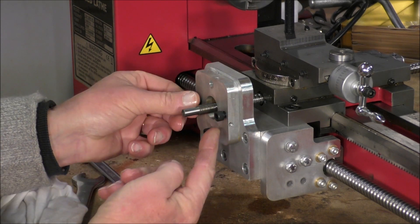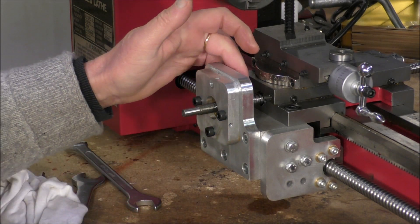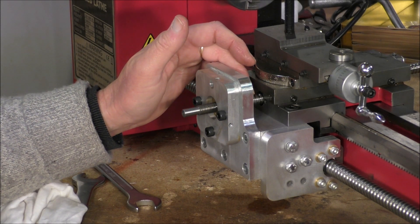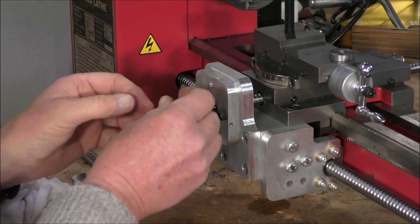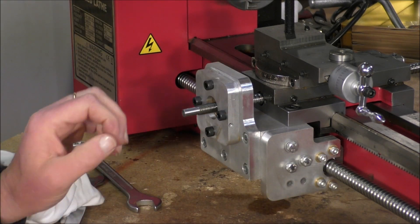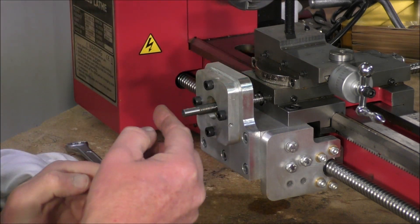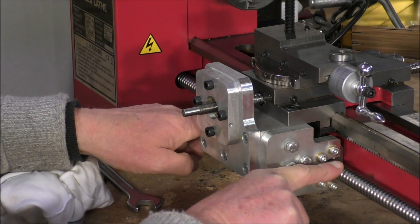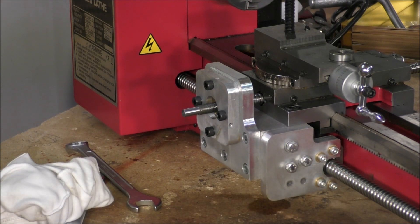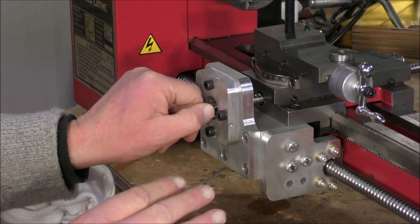These go in here — these are M6s. I've noticed some comments, so I'll explain: the zero backlash ball screw and nut I'm using for this X cross slide is a 12mm diameter with a 5mm thread pitch. Obviously use half inch if you wish, but normally these are sold in millimeter. The Z axis is 16mm with a 5mm thread pitch. So that means when you set the motors, they're set identical. We'll go into that later on.